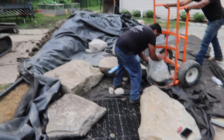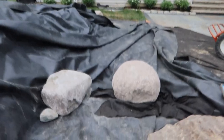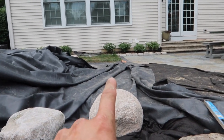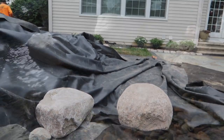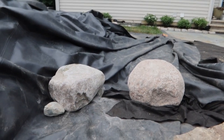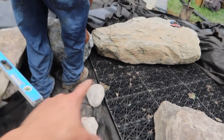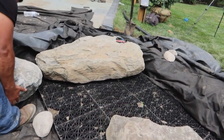It's a little before lunchtime and we got our bottom waterfall into the basin done. Udi and I are working on the waterfall up here. This one's going to be a cool waterfall because we don't really have that much of a grade change — the dirt right here is level with that patio. We've got to make sure we have enough pooling area up top and three inches of play with liner between that patio and the water line inside that pooling area. So right here it's getting more of a bubbly brook style waterfall with some cobbles, giving it that ripple effect. It's going to swing back into here, dump over this waterfall, viewing towards that awesome viewing area. We're going to get our nice bib liner in here so this water is going to zigzag in here, come back, kick back here, and then disappear somewhere in this area back into our reservoir.